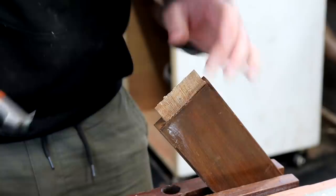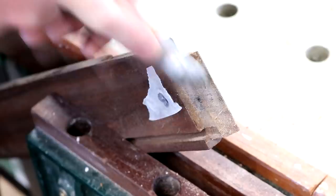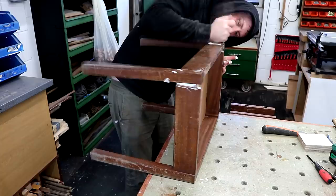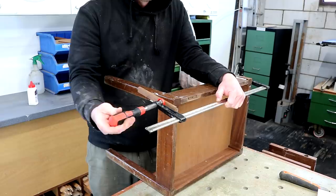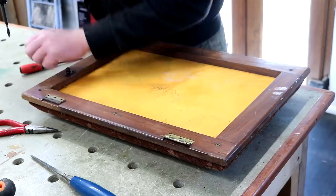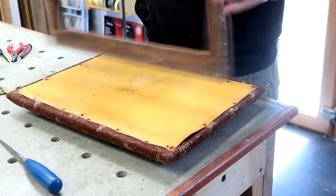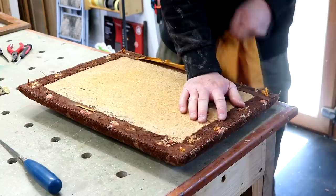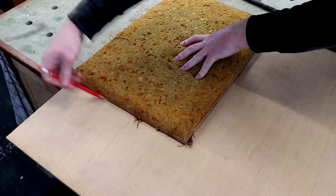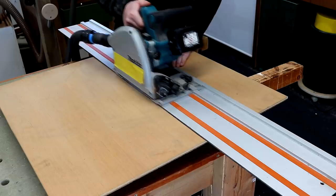Here I'm using my carbide scraper to remove the old glue from the tenons, then I can apply new glue and clamp everything back together. While waiting for that to dry I could start working on the lid. I unscrewed the frame from the seat pad and then it pulled off. I'm not going to reuse any of this old upholstery as it's probably not fire retardant, but I do want to use the chipboard on the bottom as a template to draw around onto a new piece of plywood, which I can use as the seat pad base for the new lid.